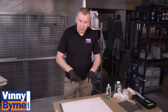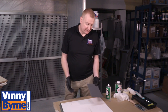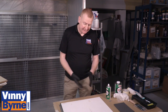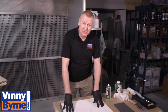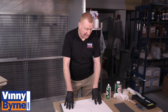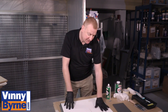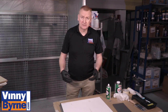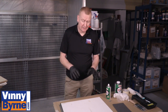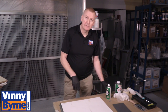What I recommend is that you degrease it first without sanding. A lot of people would sand the surface down first, then degrease it and then paint it. I recommend you degrease it first, then sand it, then degrease it again. The reason for that is, being a kitchen door, there's probably going to be a lot of greases and oils on the surface. If you jump straight in and sand it, there's a chance you're going to push that further down into the substrate. So when you come to spray painting, you may see little reactions in the surface where grease or dirt has started to come out again. To avoid that, degrease it first and then sand it.